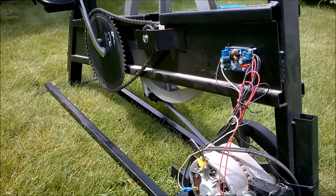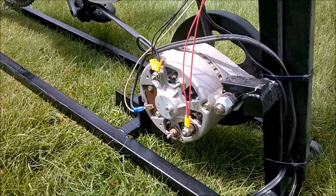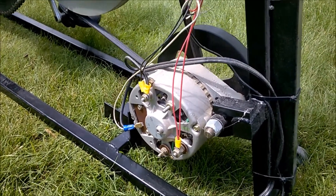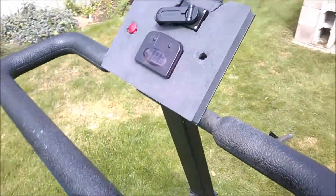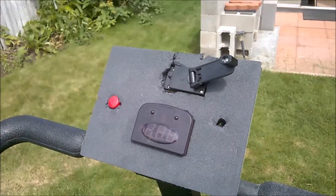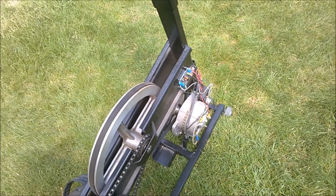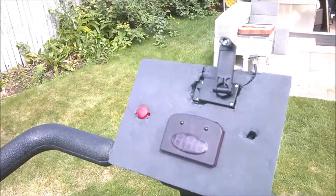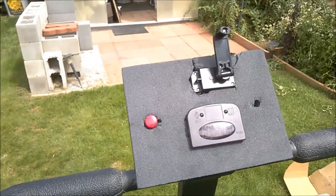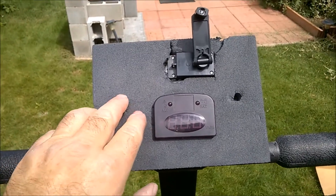Now you still have to supply some initial voltage to the exciter to get the alternator to turn into a generator — I still had to supply six volts somehow. So this is what I did: up here where the control panel used to be, I mounted a small hand-crank generator that supplies 12 volts. I've got it wired into the system below so that the initial six or 12 volts will be supplied by this little hand generator. I hooked it up to a button so by pushing this button and cranking, it'll get the whole system going.